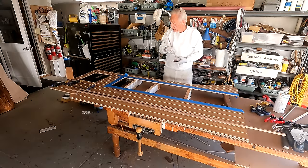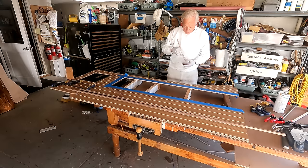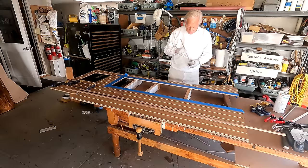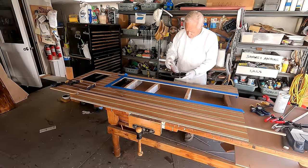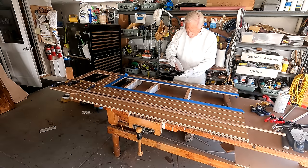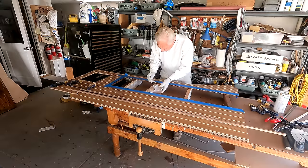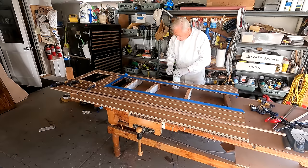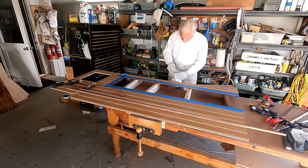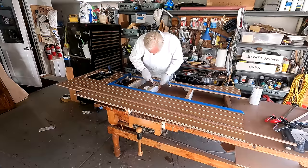You can't get any epoxy on the laminate because you can't sand it. The recommendation is to wet it out with epoxy and then add some thickener. The tape is there to catch some of the squeeze-out. I can already feel this epoxy warming up, so I'm going to get it in a more shallow container. Now we can thicken it up a little bit with some sawdust, basically.